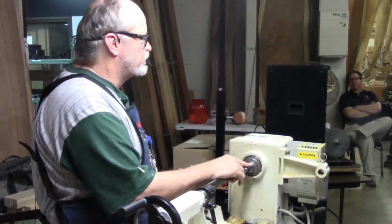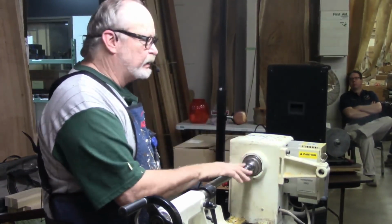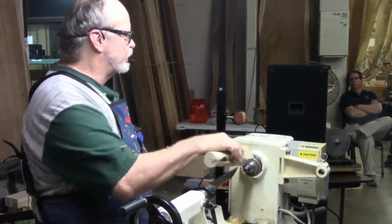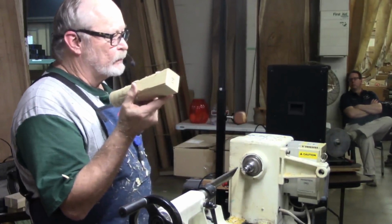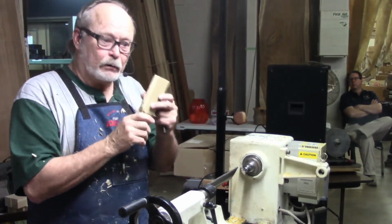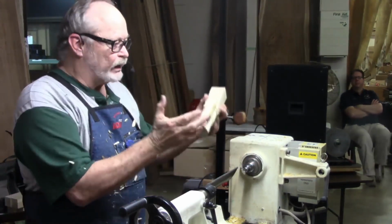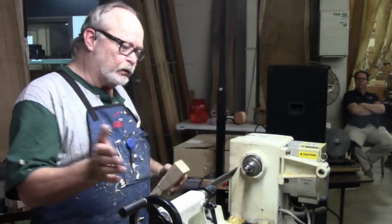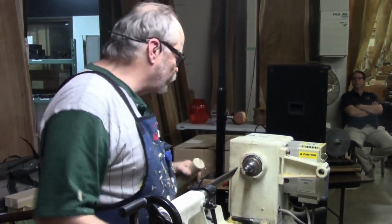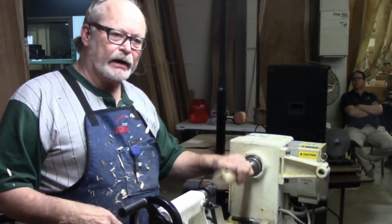There's no question. And in some places I teach, this is all I let people use. But don't think it's just for beginners. It's really not. It has other advantages, too. You can take things on and off the lathe, and guess what? It's always centered. And when I turn handles, I turn a lot of handles, I take them off and feel them. I don't just turn them, say, a masterpiece. That's not how it works, folks. You have to size it and feel it. Or I'll do a run of something. And I know you're not production turners, but you can also load and unload with the lathe running. See, there's nothing to bite.